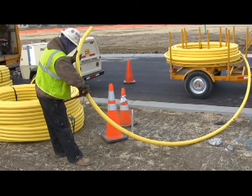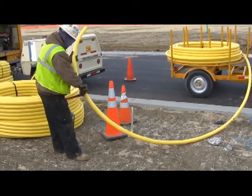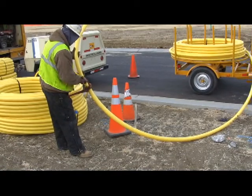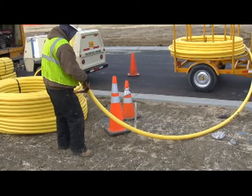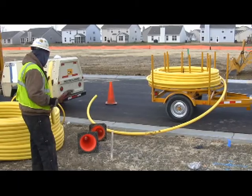The second and more common way our employees are injured is they cut the pipe without securing the ends first. Remember, coil pipe is under an extreme amount of tension while it is unrolled, and if it is not properly secured before releasing the tension, the ends can flip backward violently.